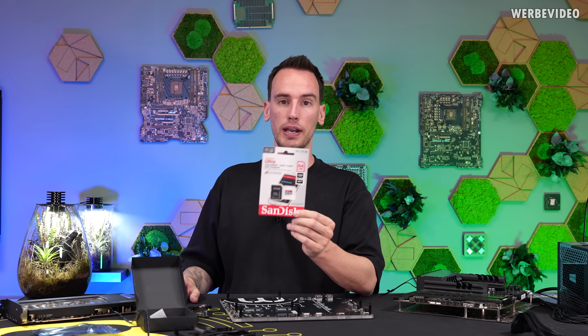The idea is to keep things as easy and simple as possible. I can take a motherboard, put it on here, connect the USB cable, and directly get mouse and keyboard plus four micro SD card slots. These 64GB SanDisk cards are not even 10 euros each, so I can have a Windows image on one, BIOS files for motherboard flashing on another, then drivers and other software. While it's not super fast, USB 2.0 is absolutely sufficient for daily stuff like BIOS updates. We're thinking of making it USB 3.0 for higher speed — this SD card is theoretically about 140MB/s, but with USB 2.0 it will be about 50MB/s. It would have been much more complex and would drastically increase the cost.